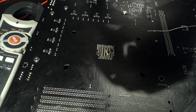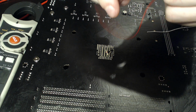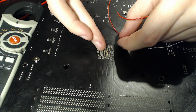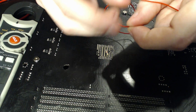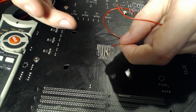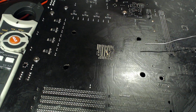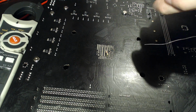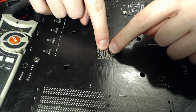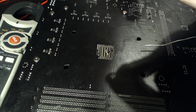And let's get our wire, and we're going to strip this, tin it on both ends, and then we're just going to attach it. How you decide to terminate your wire, you can end it with a crocodile clip or whatever else you want, because again, you have this resistor here. It could literally just be a bit of bare wire, and because of this resistor, even if you leave the ending of the wire completely bare and you touch it to ground or something, you're still perfectly safe because of that 5K. So yeah. Now, if you're running liquid nitrogen or something, and your base plate can't let you fit a resistor in place, then you might want to just go with straight wire to the capacitor bank, but that doesn't really change that much.